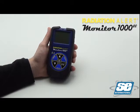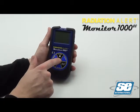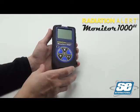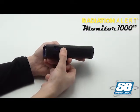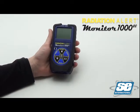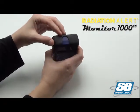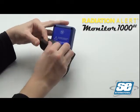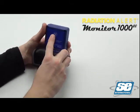It has a graphic LCD for displaying the readings, and 7 membrane buttons on the front for one-touch operation. The unit includes a ruggedized boot overlay, as well as a USB jack on the side. The USB jack does not charge the batteries; however, it will power the unit when plugged in. The radiation symbols on the top of the enclosure and on the rear label indicate the center of the energy compensated halogen quenched GM tube.